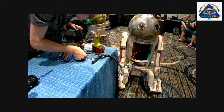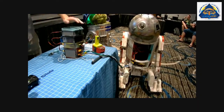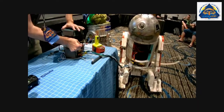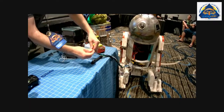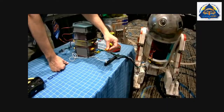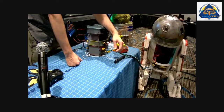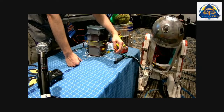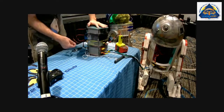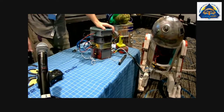So later we're probably gonna get questions on the video. Could you just tell them what type of connectors those are? Yeah, absolutely. So these are XT60. They're pretty standard. They're kind of a pain to solder, but they do have some that have leads already attached. I use these anywhere I want the thicker gauge wires to connect, so I use it for the motors, but then for the other power for the smaller ones, I just use a barrel jack.